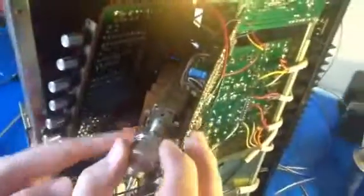These are the Dolby controls, but the most important thing in here are these switches, and this particular switch back here, you can see a little bit here, back in here, all these wafers. This is the Dolby board, which acts up and needs a good cleaning. Also needs capacitors replaced, resoldered.